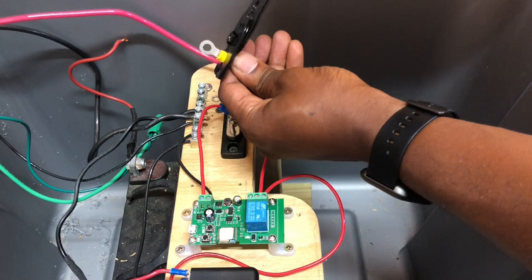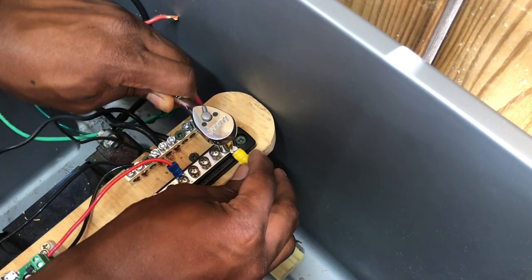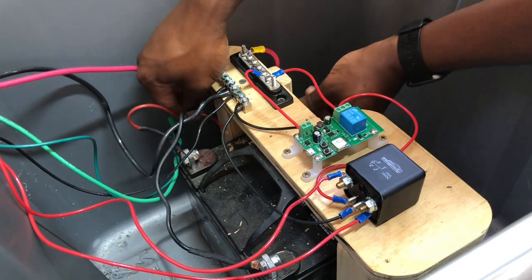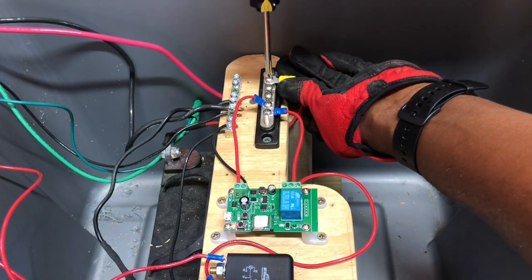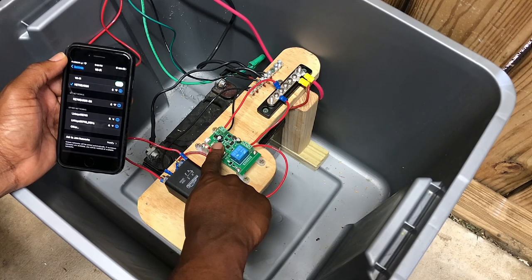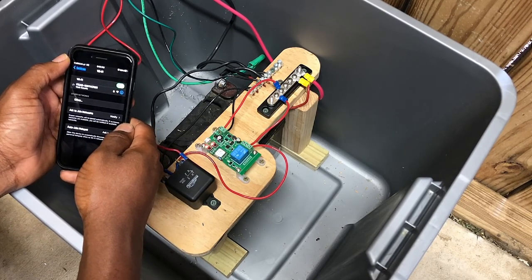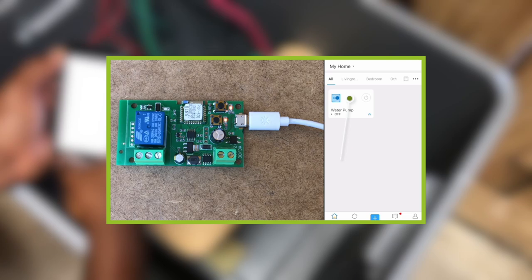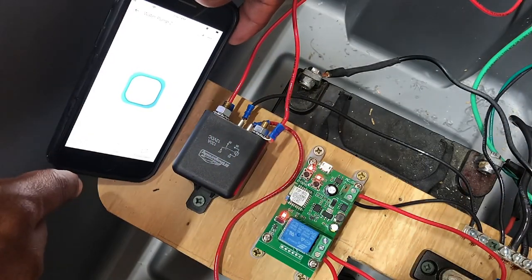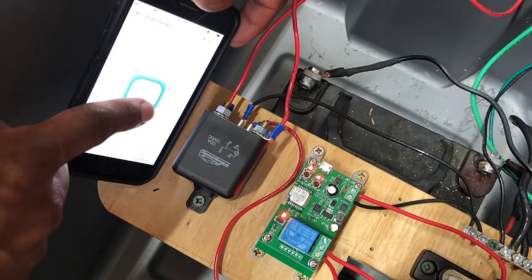Next, I connected the positive connection from my solar charge controller to my positive bus bar. Then I connected the positive terminal of my 12-volt battery to the positive bus bar. After everything was electrically wired and my WiFi relay had power, I began performing the configuration steps through the eWeLink app so that I could control the WiFi relay remotely from my phone. Since I've already gone into detail in a previous video for how to complete this easy process, I will leave a link in the description for that video and the timestamp. After setting up the new WiFi controller, I performed a quick on-and-off test to verify the WiFi relay and the heavy-duty relay were working properly.